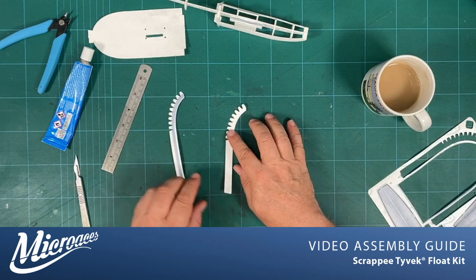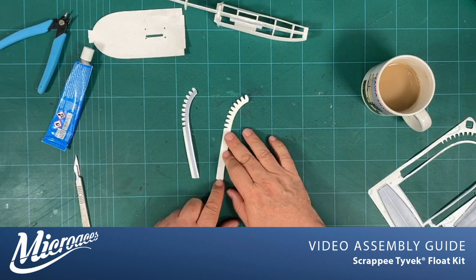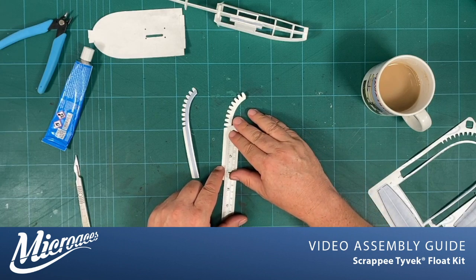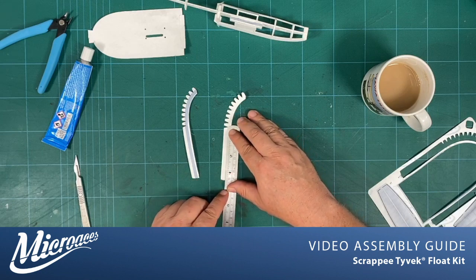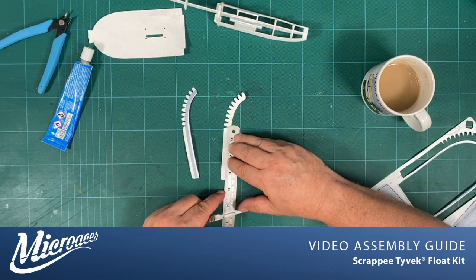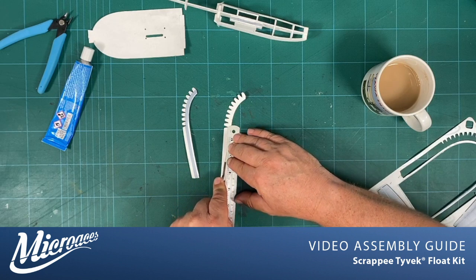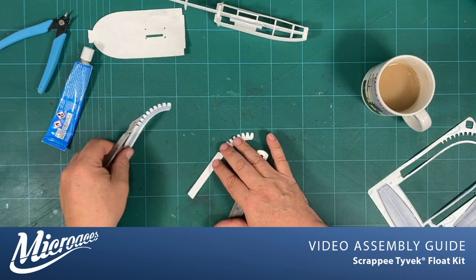And we're going to go to the underside of our T4, T5 parts. And firstly, we've got a little notch here, and we're going to take the score from that notch to the bottom of the first V cut. So hold the straight edge firm, and then back edge of the knife all the way along. There we go, to the notch.